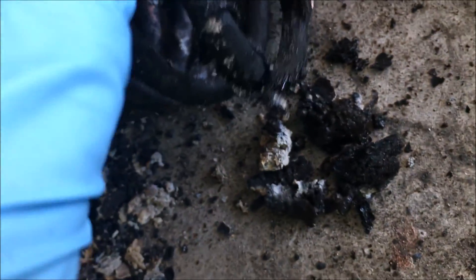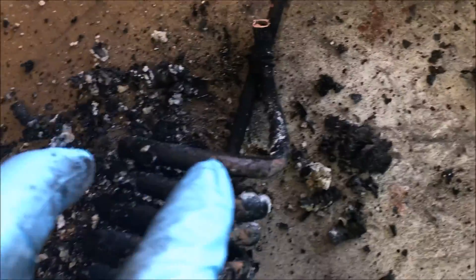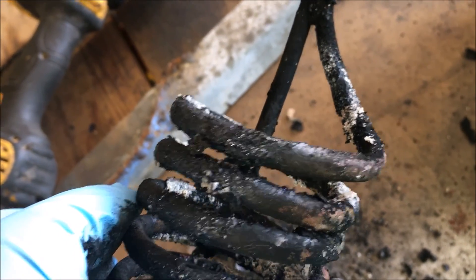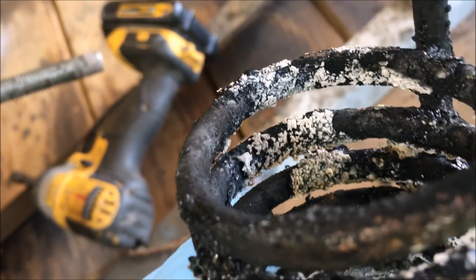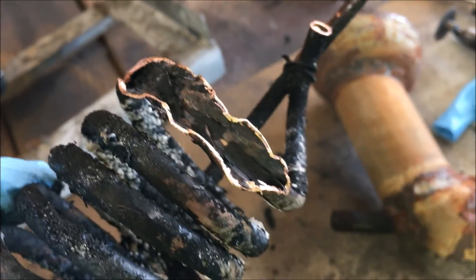My stainless steel connecting coils held up well — I was worried about whether or not they would hold. The interesting thing about the varnish we've seen right there is that it's coming right off the intake, so the residence time of the oil at this particular point in the coil is very low. I'm going to cut open an area with higher residence time, and we should see a lot more varnish there. This lower-temperature area would have allowed varnish to condense better. This stuff definitely would have clogged up the spray nozzle I initially had on there — that was a very dumb idea in retrospect.